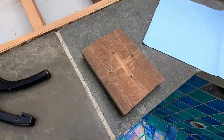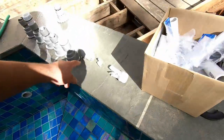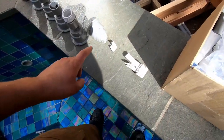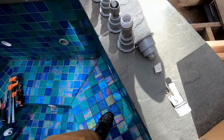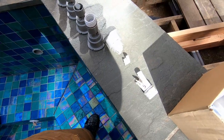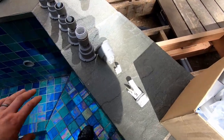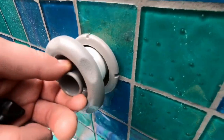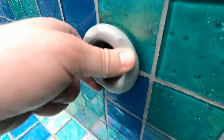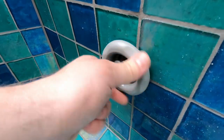I made a wrench because I wasn't going to wait to buy one, and it works perfectly. This bad one here when I was putting it in just sheared off. All the other ones were fine — I put a little lubrication on the o-ring — so that was a bear trying to get that one out. Thank God I did, because if I was stuck inside it would be a big pain. I did end up getting a couple more jet housings and they went in pretty easily with that new measurement, and then all the jets just screwed right on in and they look pretty good.